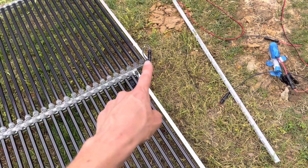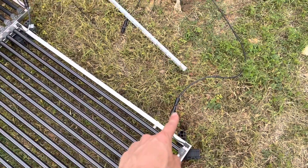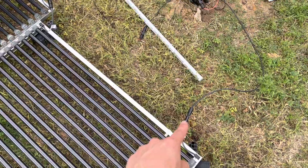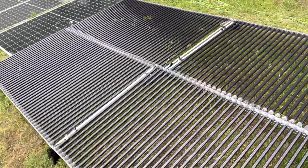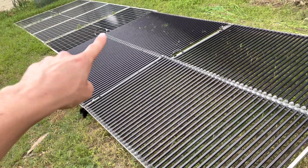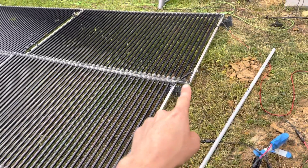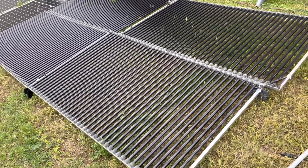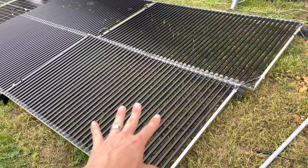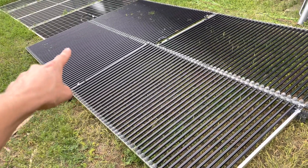So there's our main positive and main negative. These connectors are of a Tyco brand, and they are not MC4 connectors, even though they kind of look like them. So what I did is, where I want to run back to my inverter, I just snipped the end and put an MC4 connector on there. If you buy some panels from me, I'm perfectly willing to do that for you so you don't have to grab crimpers. That connector is also a series connection — it's redundant because you already have this connecting the two in series, but the manual states you can just go ahead and connect it. Each of these panels is like two and a half amps a piece, and you can do up to 23 amps parallel without any fuses, which means you can have eight of these coming down.